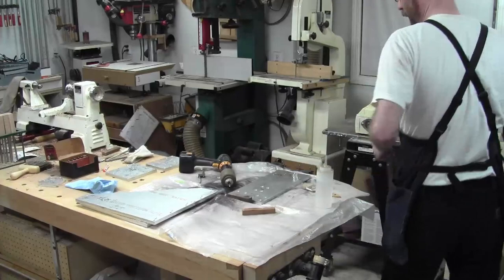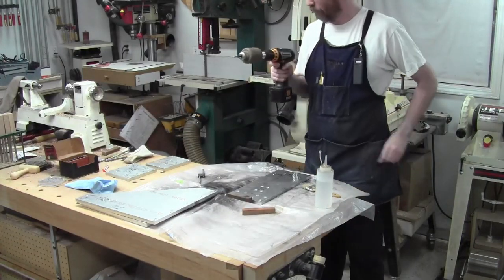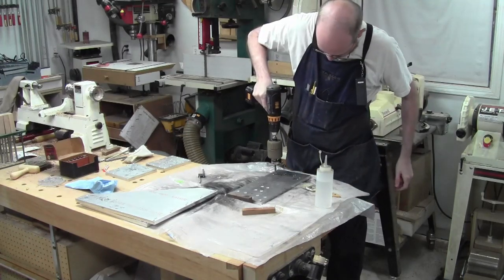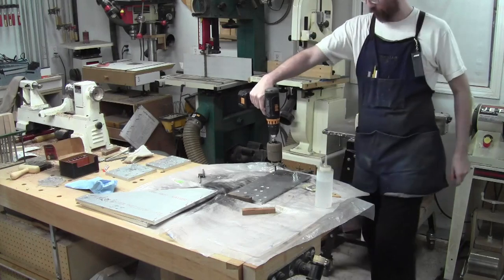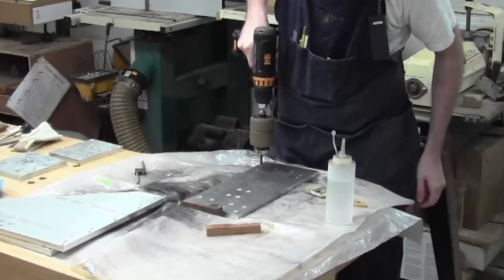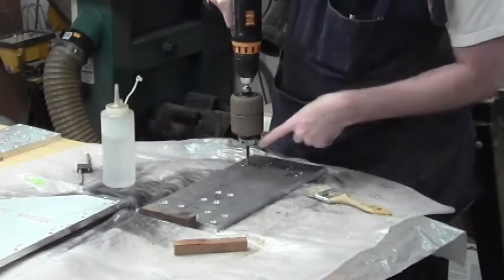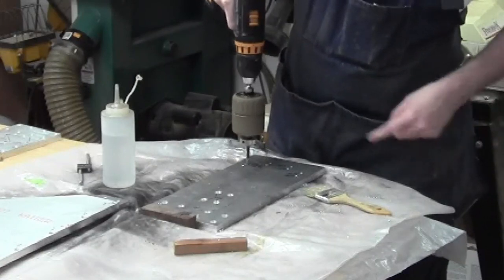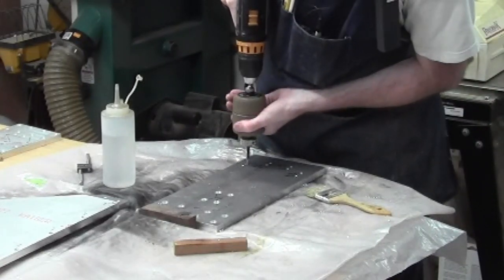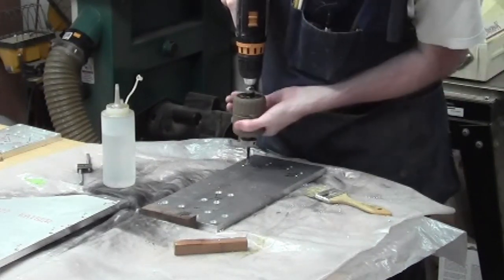Right, so I got her on the drill. It's kind of an obnoxiously big contraption, but put it in low speed and we'll start a new hole with her. I find it actually kind of helpful in getting straight because the line is longer. And we can spin, see, I can drill without holding onto anything, the tap just stays put. But if I put my hand and grab this, I can start it. And if I let go, it just stops.